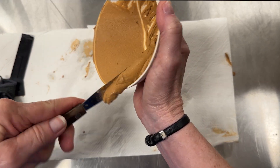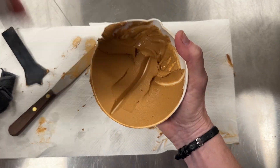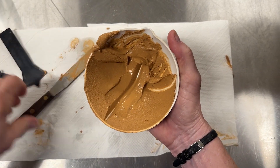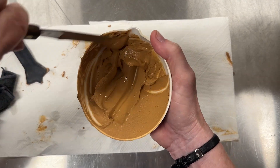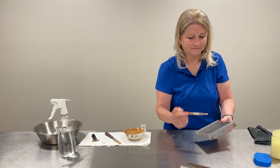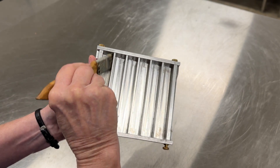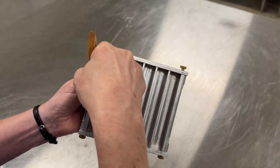If a slight jarring is required to close the groove, or if the soil is obviously too wet, add more water or dry soil and remix the sample. Grease the inside walls of the bar linear shrinkage mold with a thin layer of petroleum jelly to prevent the adhesion of the soil to the mold.